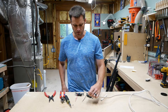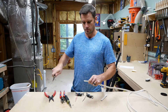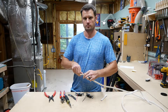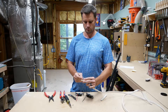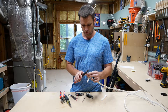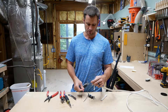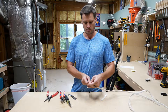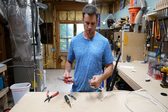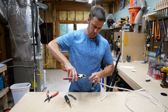Let's say this is the main line coming into the house, or coming into the circuit — let's just strip this here. So if this is the hot wire right here, we're going to strip this as well. This is hot, so we want both of these to be hot. What we're going to do is get these three wires, set them together, grab our lineman pliers, and twist them together.